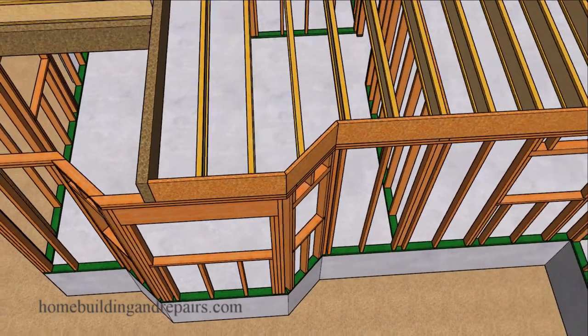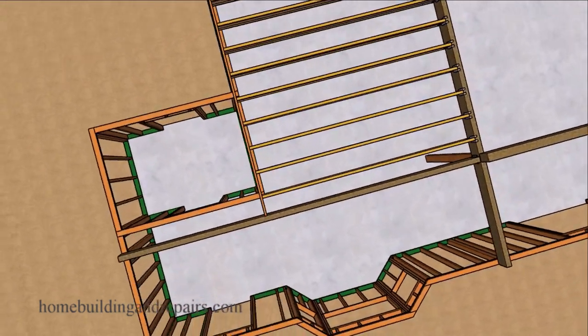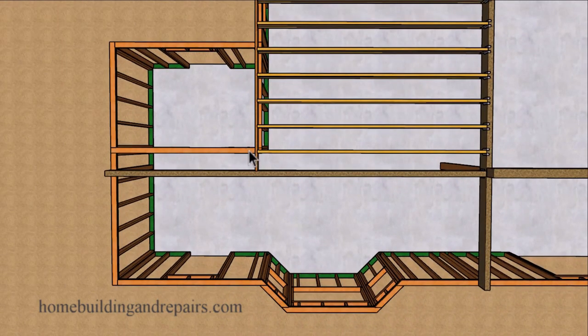For those of you not familiar with my channel, these are only construction methods that might work — you might need to hire an engineer or contact your local building authorities for permits. All of the joists in this example will be 16 inches on center. If I moved this wall over, I could make the beam shorter. However, this beam needs to be in this location to work structurally with the roof, so you probably won't have a choice of moving the beam back.